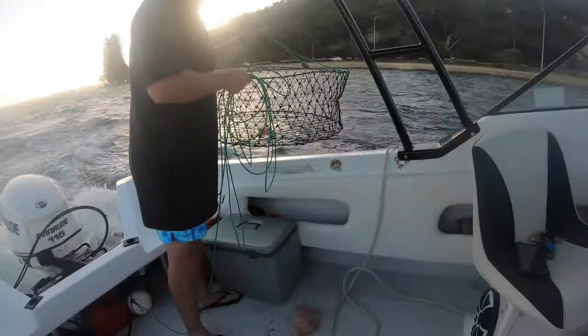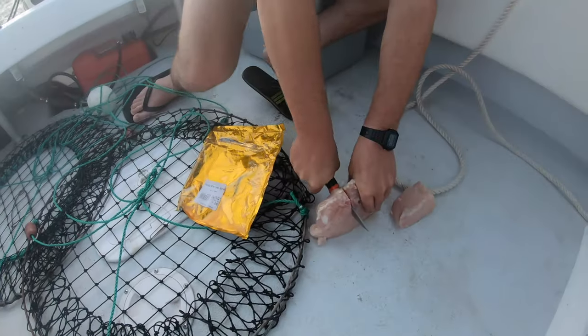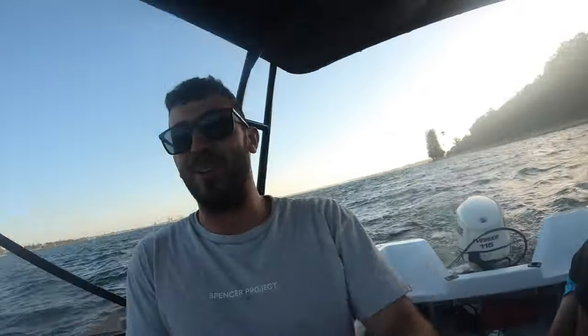We're at about 4.6 metres depth. I'll slow down a bit and throw the pots in. I'm testing the boat because we had a couple of fuel problems — water was getting into the tank, and surprisingly a faulty breather was letting in the water. Water is heavier than fuel, so it was the first thing to get sucked up. But I've got a brand new filter, a brand new separator, a brand new breather, and a brand new fuel cap. We're using some of mum's chicken as bait — we're not really prepared, we just thought we'd come out for crabs. It's a beautiful night, a little choppy, but the crabbing should be fine.